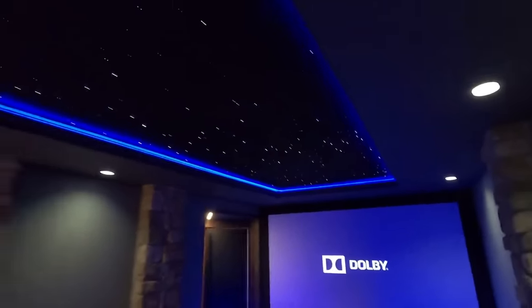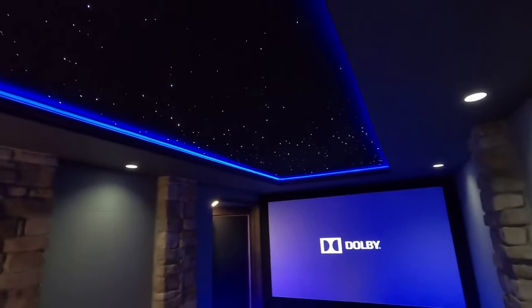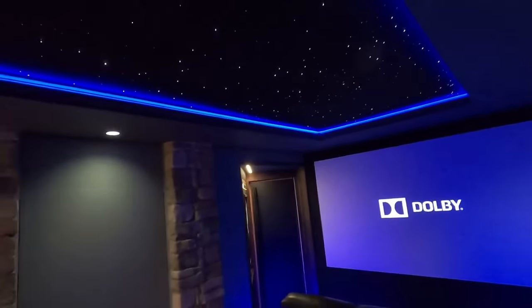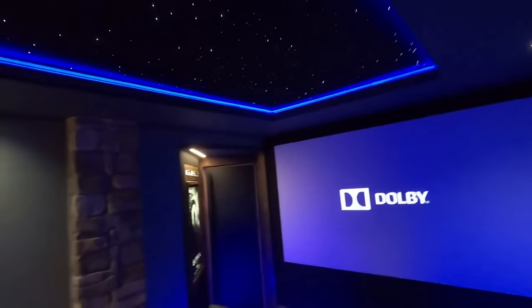Star ceiling is two star kits from Epic Sky and then one shooting star kit. Again, cove light. All of our cove light jobs we do, 90% of them, we'll try to put diffusion on the top of it. So we'll put it in an aluminum channel and we'll put the cover over it. That gives you the good light output that you're seeing.